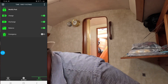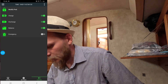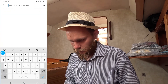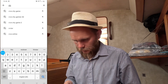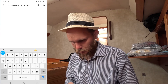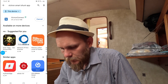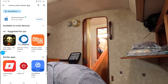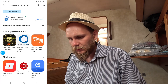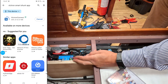I would believe so. So now we have plus and minus. Let's try to download the app — it should be in the Play Store. I'll search for 'Victron Smart Shunt app.' I can see already I made a mistake — I thought it should power up but it didn't. The reason is I put the plus cable on the wrong slot. Fifty-fifty chance and I got it wrong. So I need to go back into the app and disable all battery features to make it safer to disconnect the plus wire and connect it to the right terminal.